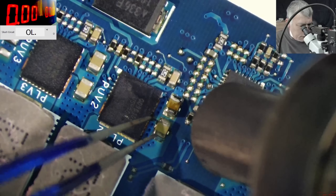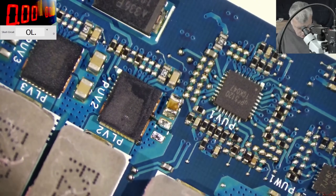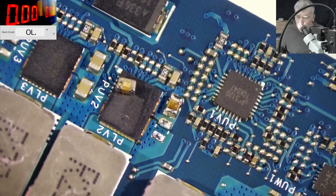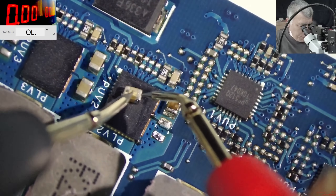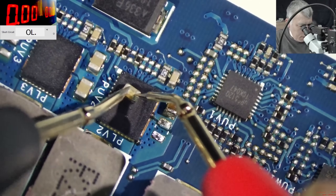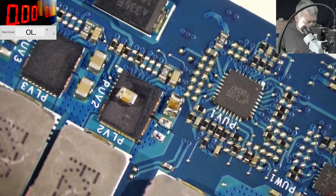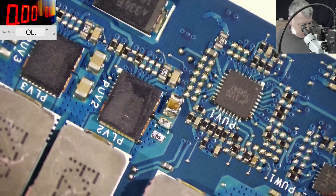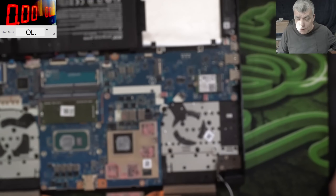It's like going to the dentist and they take out the wrong tooth. So it's this one. This capacitor - you can see it's cooked. And the capacitor has 2.4 ohms. This is what got me believing it was a MOSFET - it's a high resistance short. It's actually a shorted capacitor.